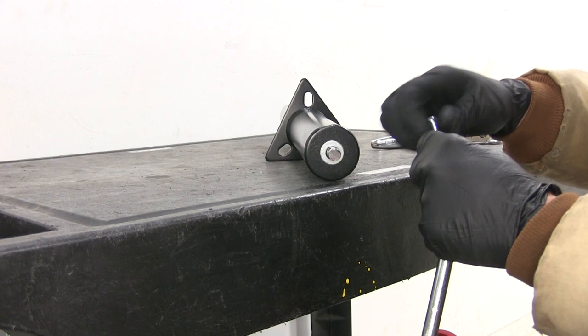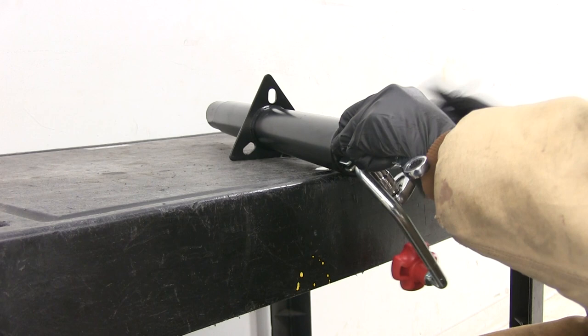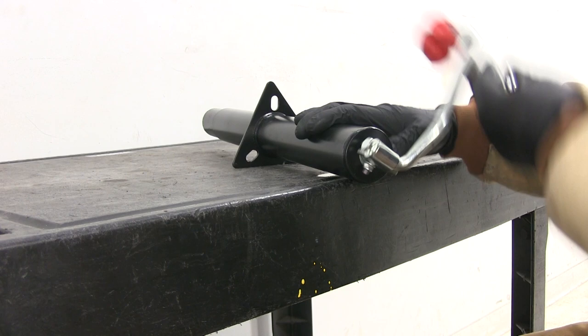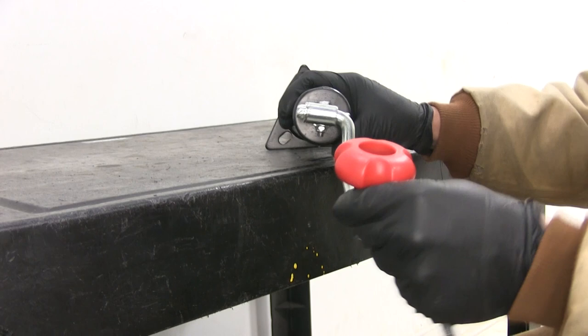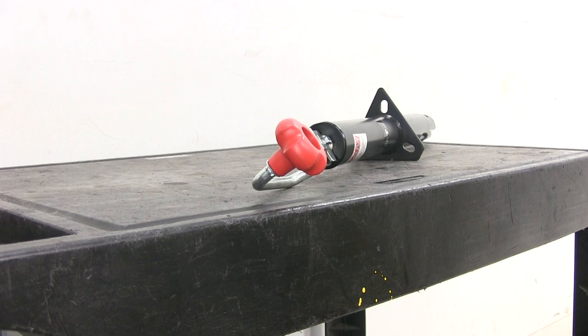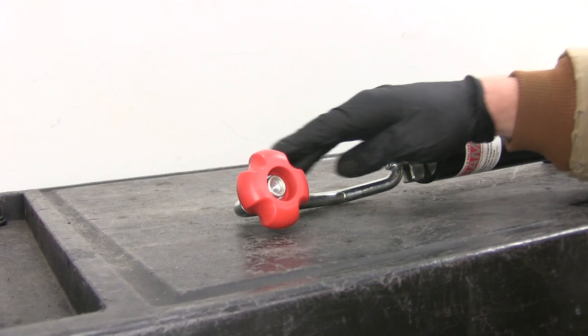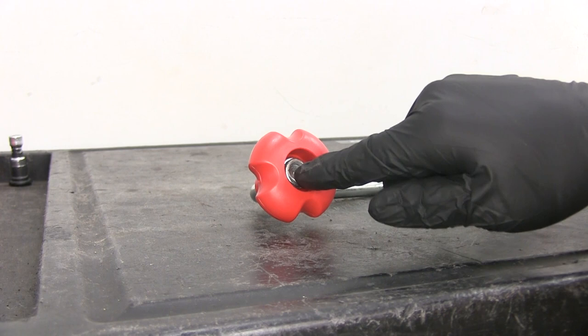As we tighten our handle down, we don't need to over tighten it — we just want to have that clamp come down and squeeze on the main head of the screw, and at that point it's ready to go. Now sometimes you might run into something or accidentally bump it, but sometimes this knob on the top will crack or break. What they've done is spread out the top of the handle to hold it in place. What we're going to do is use a half inch drill bit right in the middle of that — it would be almost like we're drilling out a rivet.